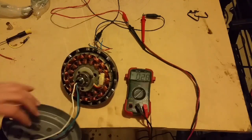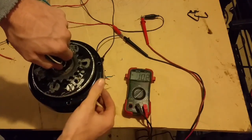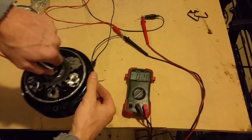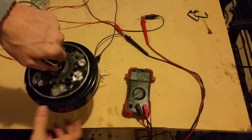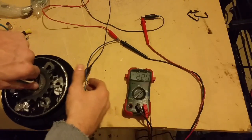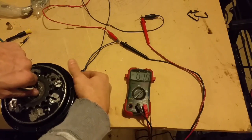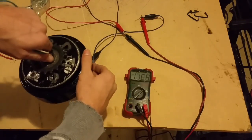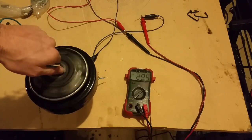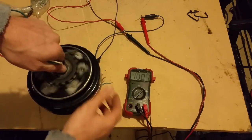The neo magnets are evenly spaced, opposite poles — north-south, north-south. Put the top back on. Now let's give it a spin — a light spin — and you saw 10 volts at the light spin. That was 27 volts. It's probably seeing a lot higher temporarily — it says overload — and then it finally settles around 27, 28, 28 and a half, 35.